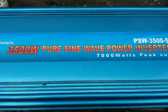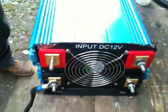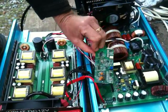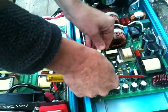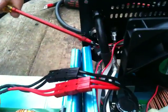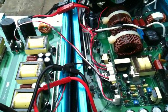Introducing the Power Jack inverter. This unit was plugged in for the first time and absolutely nothing happened. So I came along and had a look at it. The first thing we noticed was that this board was just lying in space, not connected to the connectors there, and there's no way that would have just come out in transportation — it's fairly secure there. Another immediate fault was this wire hanging off here. I felt fairly confident that once that board was in everything would work, but unfortunately it didn't work at all.